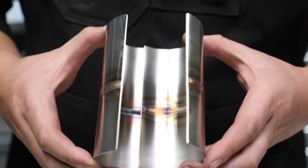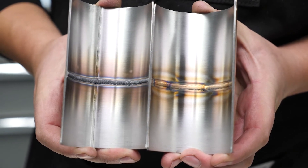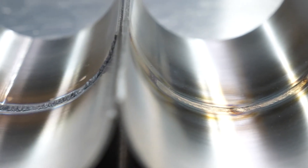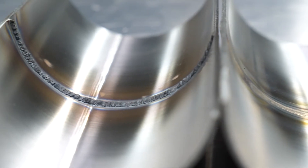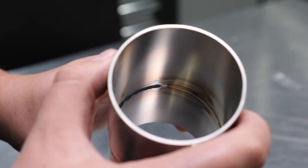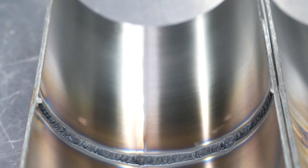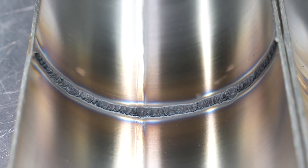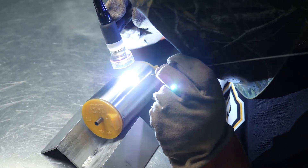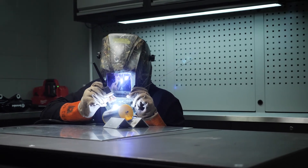With our two samples welded and then opened up, you can clearly see the improvements to the quality of the internal weld when purging was used, and it should be easy to understand the effect this can have on weld strength and reliability. We can also see the dull and porous weld that makes up the back side of the part we failed to purge. There's a good chance that this will present some strength and cracking issues over time when we introduce vibration and thermal expansion and contraction.